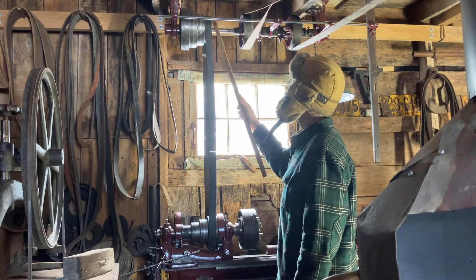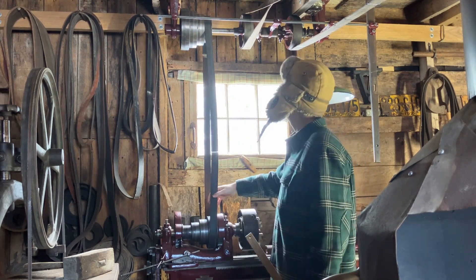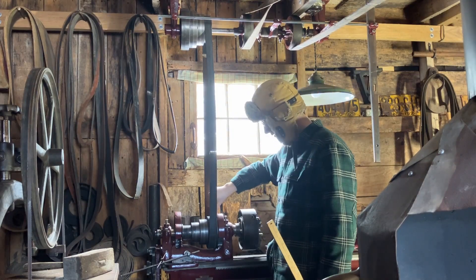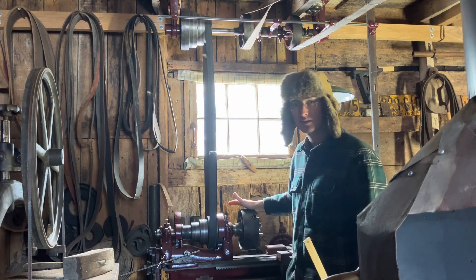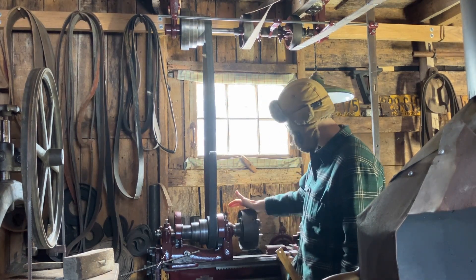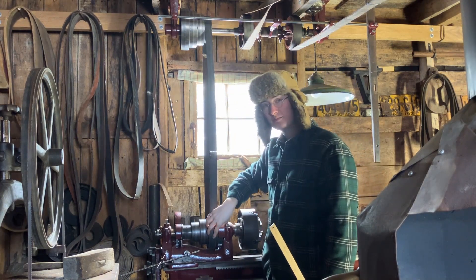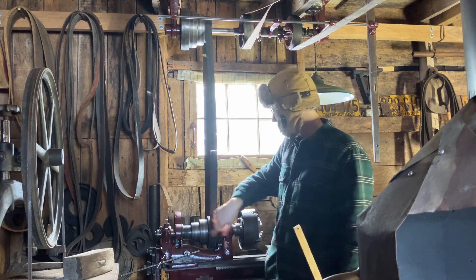From there you work with the stepped pulley ratios. In first gear — the first pulley step — this is about 6 inches on top and about 6 inches on the bottom, so it's a one-to-one ratio and the machine will be running at about 285 rpm. That's the slowest speed, because small up here and big down here means a slow machine, while big up here and small down here means a fast machine.